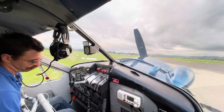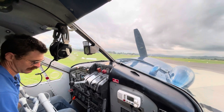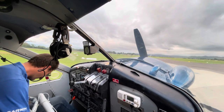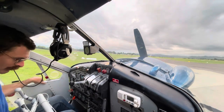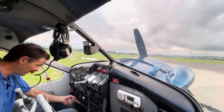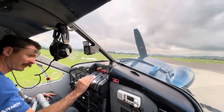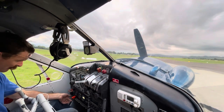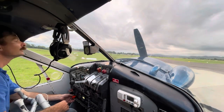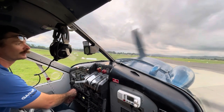Give it a one, two, and three — primer in and locked, that is latched. Shut the door. We'll go master on, beacon on, engine instruments on. We'll put some shots on the accelerator pump, just crack the throttle open so it lights off at a very low RPM. We're going to crank it through five blades to prime all the cylinders and then get the mags to both. We are all clear — clear prop. One, two, three, four, five — mags on.